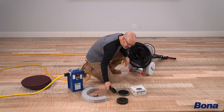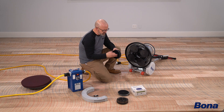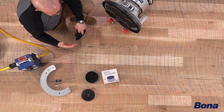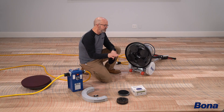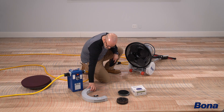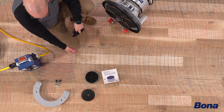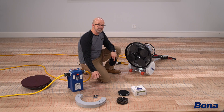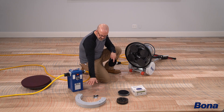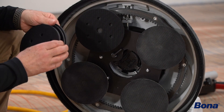We're going to run steel plates. Even though this is going to be my first cut on this floor, a lot of times guys love the steel plates because they keep everything nice and flat. They will definitely tell you when you've got situations like chatter — and this chatter is not from a sanding machine but actually from the production and planing process at the manufacturer. I'm going to use that flat plate to make sure I get all the chatter out of the floor.